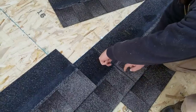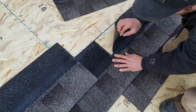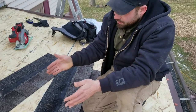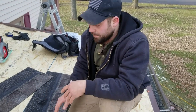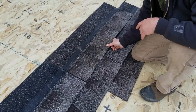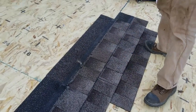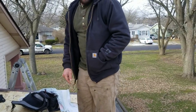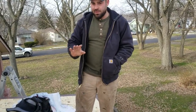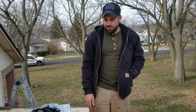There's a shingle below this, just the way that there will be. What you're looking at here is going to be your felt paper. So now your roof will be relying on its underlayment to be dry. That's why you can't use shingles like this on 2/12s and under. All right, if you're gonna use it on a 3/12, I don't know if code requires it, but I would probably ice shield the entire roof if it's a 3/12.